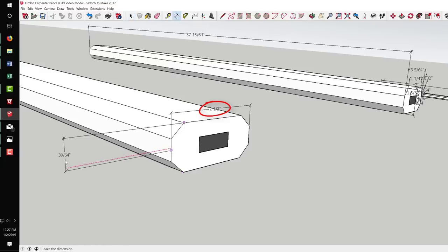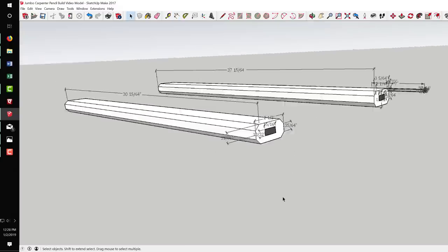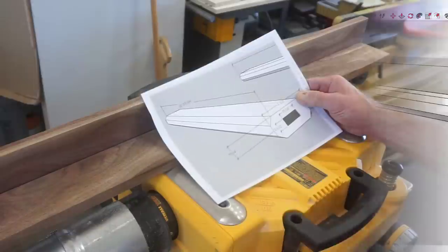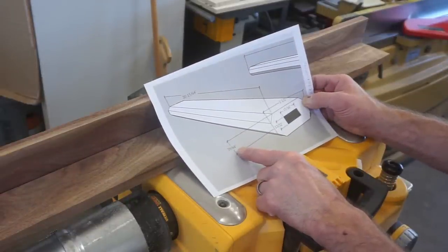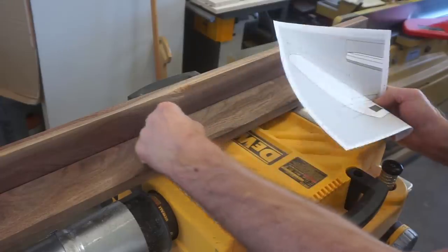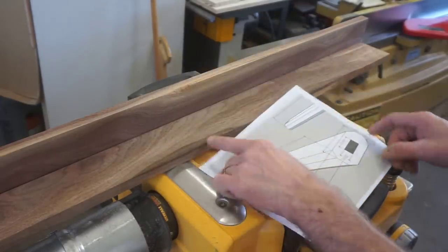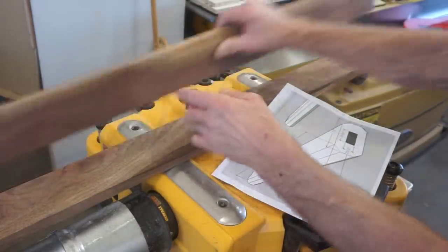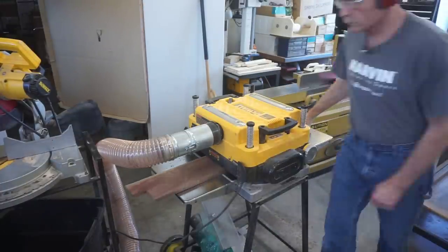Once I've rescaled it to 2.5 inches width, I'll add the other necessary dimensions for fabricating these parts in the shop so that the defects in the wood can be cut around to end up with a smaller but clean jumbo pencil. Back in the shop, I'll use these dimensions, primarily the 39/64 inch thickness for these at a 2.5 inch width and a length a little over 30 inches to clean up the bark, this bug damage, etc. from these pieces.